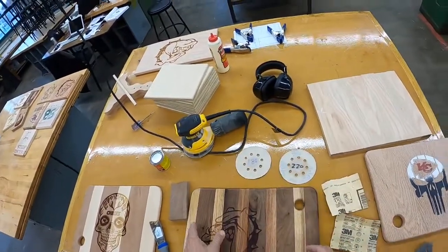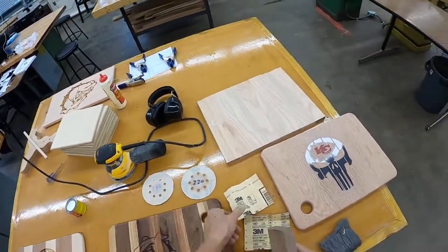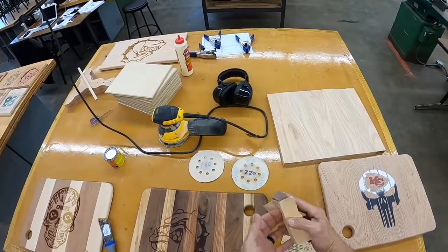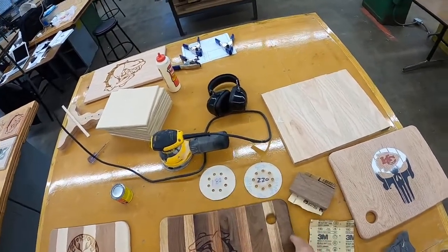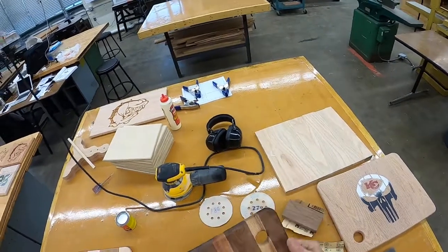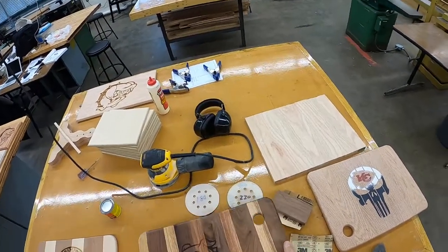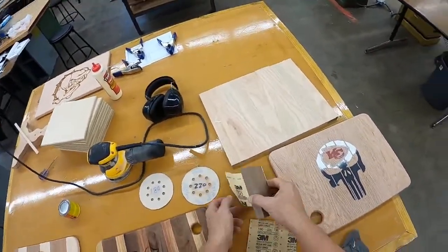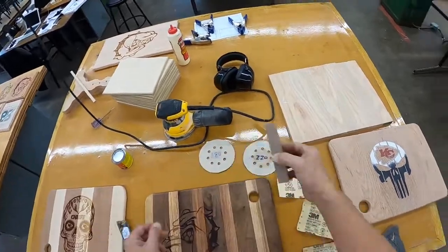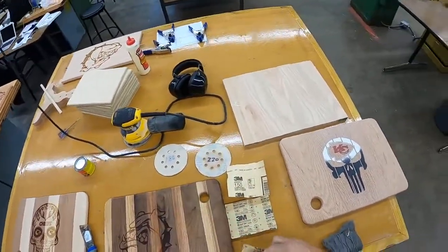After you sand with the orbital sander, you hand sand. You get sandpaper and a block. You do your edges, your corners. You can't very well do that on the rounded parts with the orbital. So you'd get in here with your sandpaper and get the hole sanded and your edges sanded. And once again, 150, hit it, 180, hit it, and 220 is what you finish with.